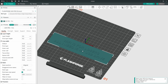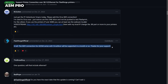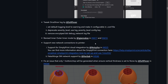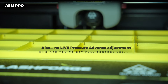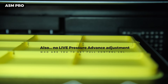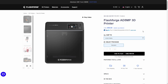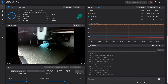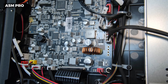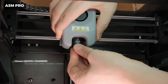More major things are related to firmware and software. The biggest downside was the inability to print directly from the official Orca Slicer. After 3 months of no progress from FlashForge, the 3D printing community saved the day — direct G-code uploading will be supported in the 2.0 release of Orca Slicer. The remaining inconveniences will be the inability to manually control fans, the automatic heat bed shutdown after 10 minutes when preheating, and possibly a wrong rotation distance value requiring too much flow rate compensation. The A5M Pro has such nice hardware for the price, especially at around $500. I would just like to see FlashForge not locking down access to regular Klipper interfaces like Fluidd or Mainsail, which would allow easy fixing of firmware-related issues and be a huge advantage compared to Bambu Lab's closed-source firmware. The A5M Pro is the first non-Bambu Lab printer I'm actually looking forward to using daily.